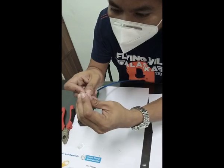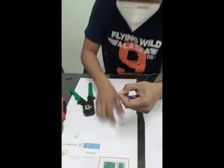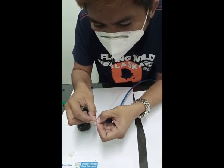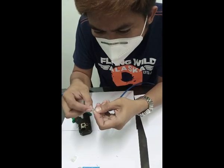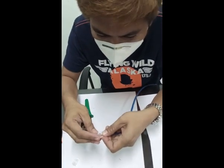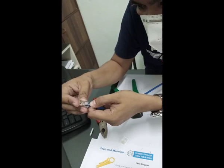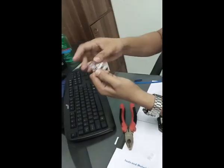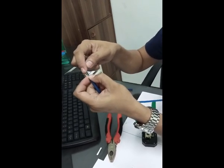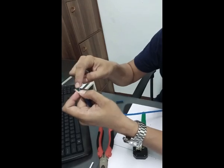Cut the overlap. White, orange, orange — switch. Now the trickiest part: avoid twisting the wires without your knowledge; sometimes they twist automatically. Insert it back. White, orange, orange, white, green, blue. Check that the blue is not swapped with the green. Before doing the final crimp, double-check the quality of the color coding.